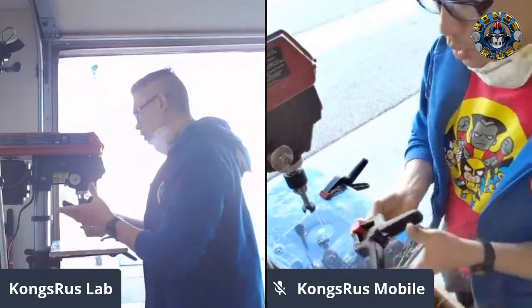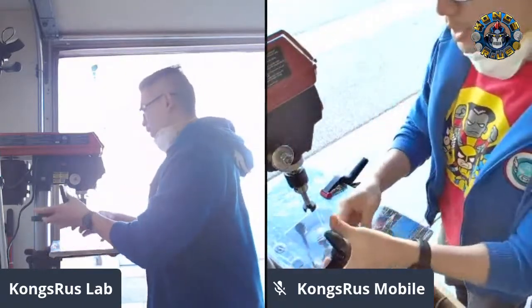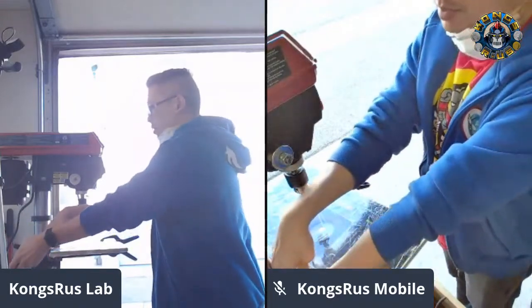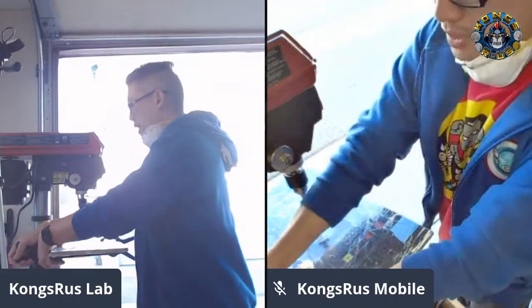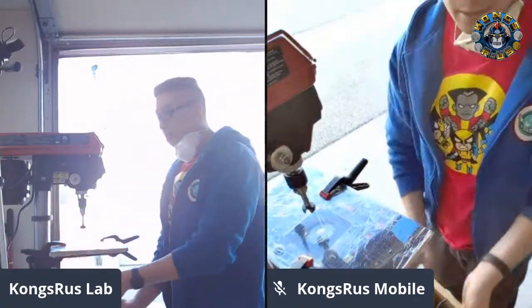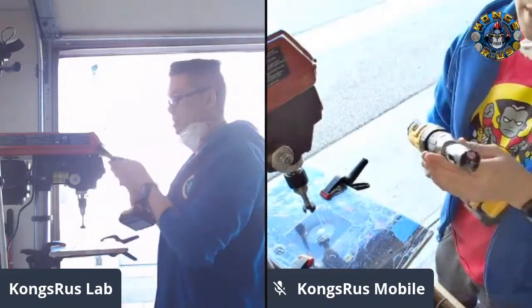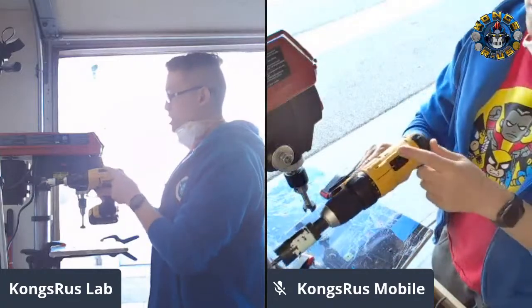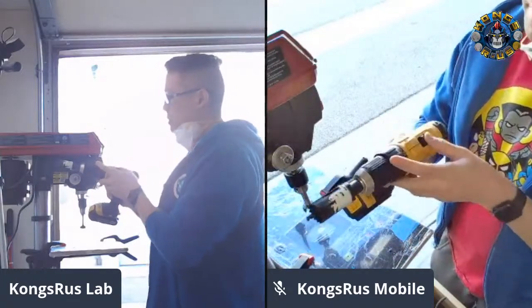just so I have a little bit more security to this when I'm drilling. Because when you're using a hole saw, you have to have the bottom of the board exposed. When you're using a Forstner bit, you have to have a board underneath. But when you're using a hole saw and you have that arbor, you have to make sure that there's an underneath space here. Okay, so let's go ahead and do this. Have my drill here. Have this set on the number two drill side so I can get some extra power, but I'll do that in a second.